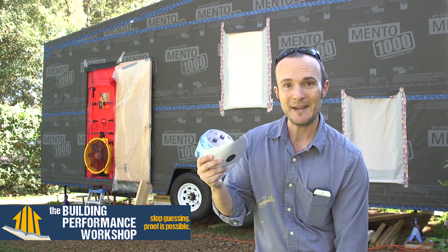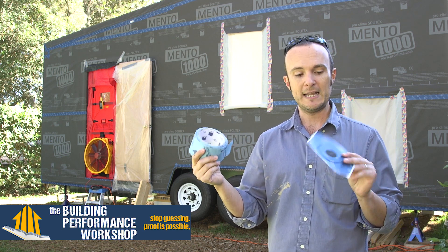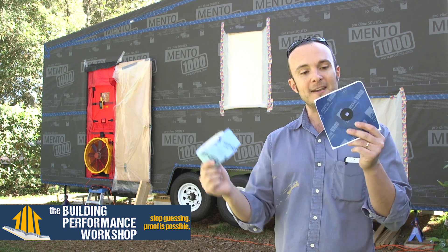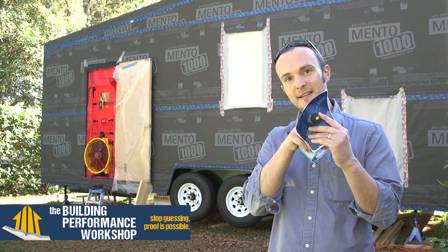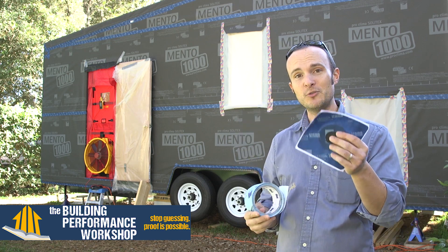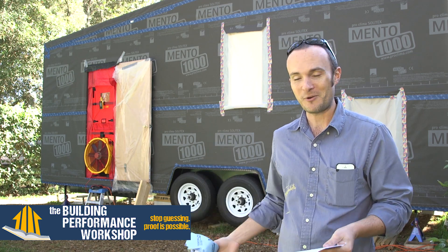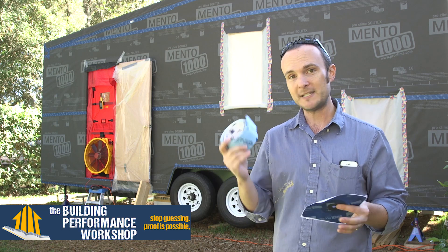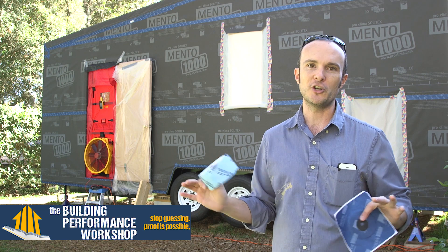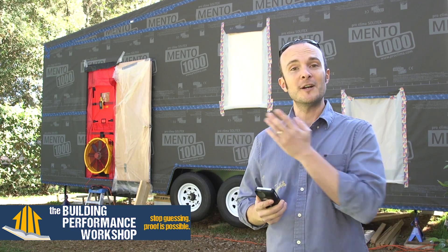Instead, I'm using really cool, sexy tape. This tape is from Germany, but you can get it in the States through 475 Building Supply — it's from Proclima. This does all the air sealing, and it will seal holes through the building. For ventilation chutes, plumbing, and stuff like that, it's got a really nice rubber gasket. It's very clean — you do have the backing that ends up getting thrown away, but that's it. In Europe, this is what they're doing all the time. It takes a little more time and a little more finesse, but it works and you don't have a bunch of goop squeezing out everywhere.